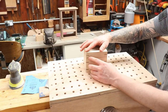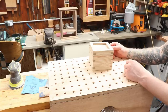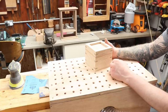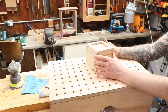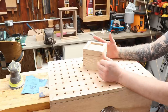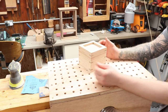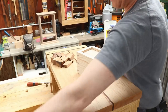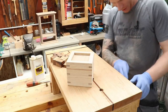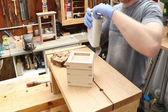We have a nice little orange cherry line in there now, which should look nice when we hit it with the Danish oil — gives a nice contrast and a nice little break between our lid and our box. I think we recovered well from that. Now I'm going to continue sanding the box up to about 300 grit, and when that's done we'll put the oil finish on. Time for my favorite part — applying the finish, because you get to see your piece come alive. Let's get some oil on this thing.